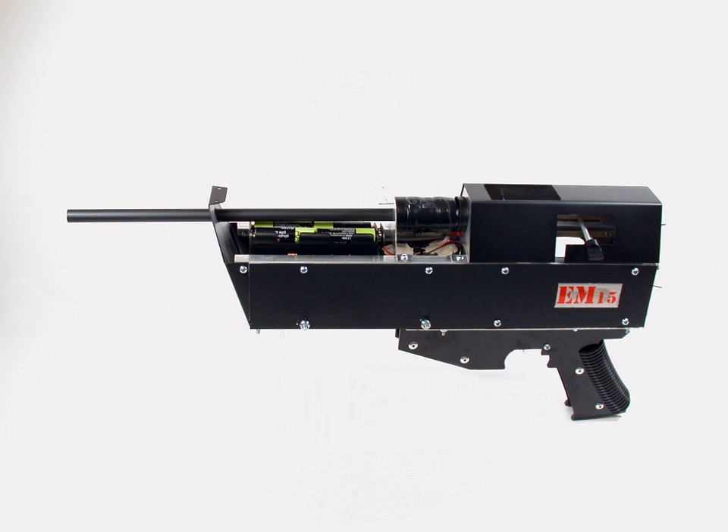Small coilguns are recreationally made by hobbyists, typically up to several joules to tens of joules of projectile energy — the latter comparable to a typical airgun — and an order of magnitude less than a firearm, while ranging from under 1% to several percent efficiency. In 2018, a Los Angeles-based company, ArcFlash Labs, offered the first coilgun for sale to the general public. It fired 6-gram steel slugs at 45 m/s with a muzzle energy of approximately 5 joules. Much higher efficiency and energy can be obtained with designs of greater expense and sophistication.